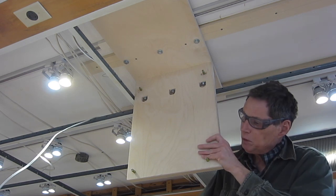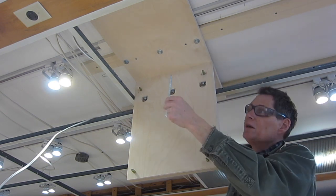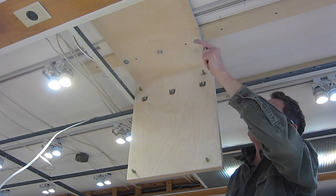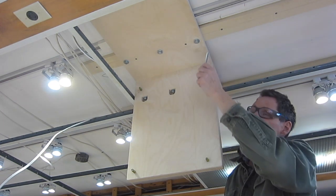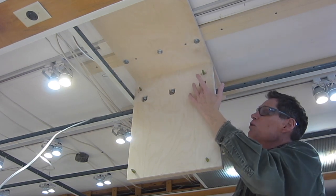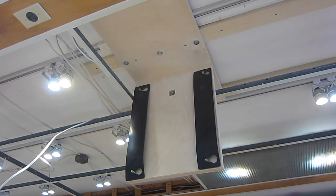Here's my bracket to support the blower, secured to the ceiling with six six-inch lag screws — three on each side — going right into the ceiling studs. Taking into account the thickness of the plate, the piece, and the drywall, I get about three and a half inches into the stud, which is probably good. I drilled a quarter-inch pilot hole so I don't split the stud. I've got three-eighths-inch bolts running through and tightened up, making it very secure. The blower was supplied with quarter-inch-thick rubber dampeners that reduce vibration to the whole structure and make it run a little quieter.